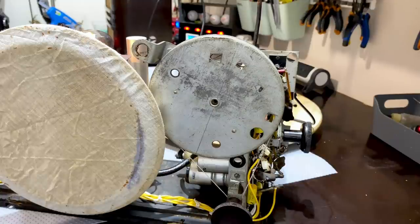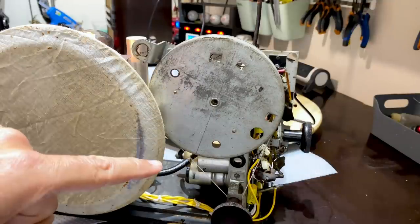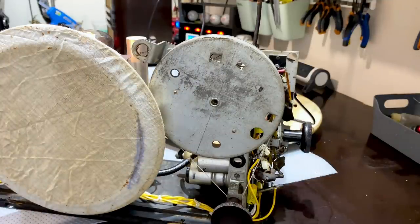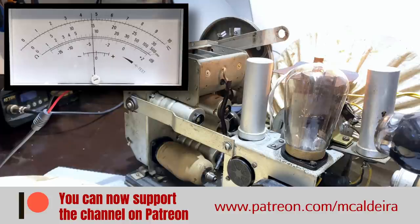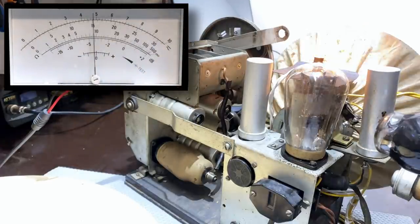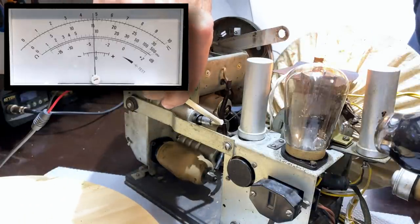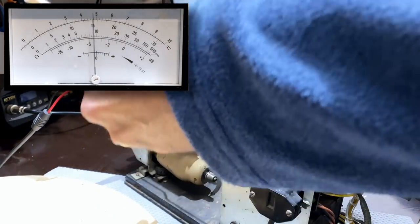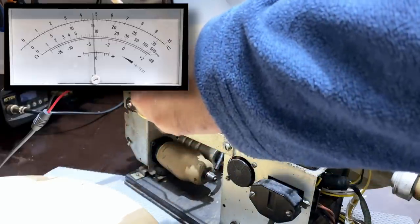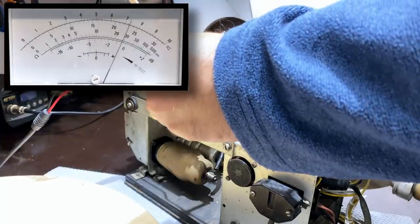And now we have to look at the meter and adjust those two coils at the top, the antenna and the RF filter, to a peak. That should be quite easy. Okay, folks, now I can't do this without audio, so we're going to have some noise, and we can see that on the AC voltmeter. Now, let me try and do this without another zap. Can I get this in there? Okay, it's in there. Oh, wrong way. Oh, nice.